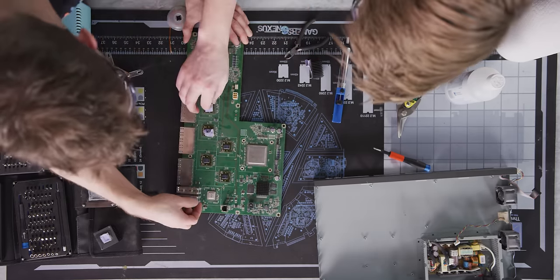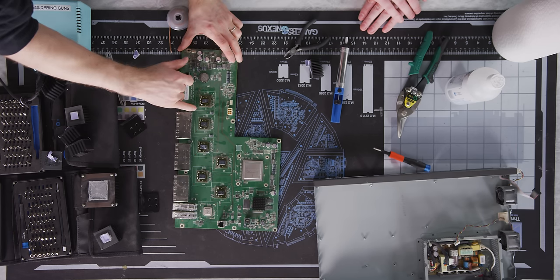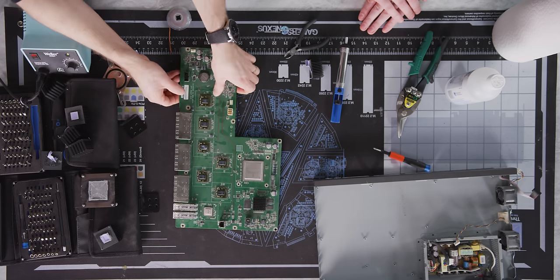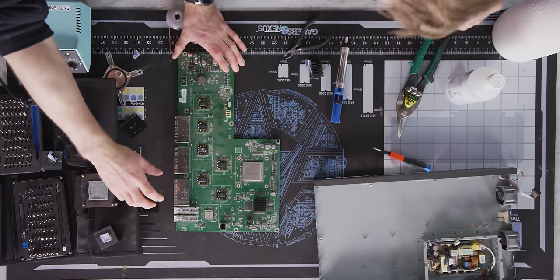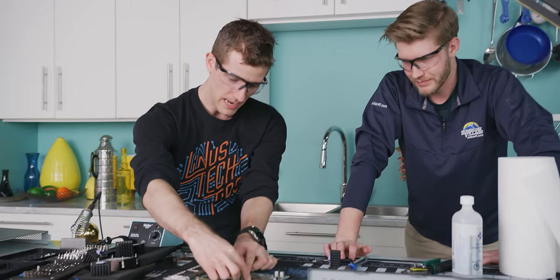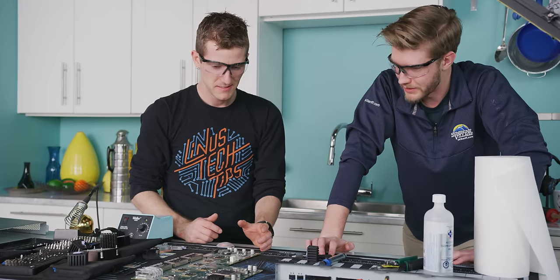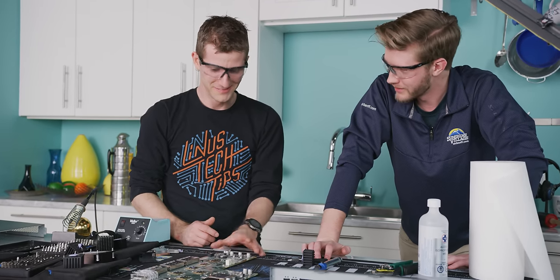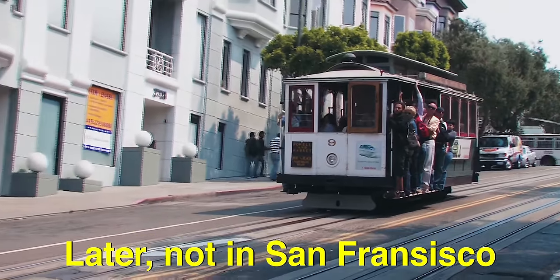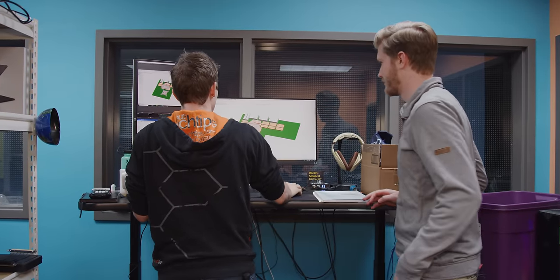So you've got a couple of challenges. These look like they're up a little high, so we might end up having to go around them. Also, not all these holes came clear, so we might have to either pop them back out or actually desolder them properly if we want mounting points for our block. Your copper slab to cover it is probably the simplest way. Here's our main CPU block — and then we do a short heat pipe here and a long heat pipe there. This is actually going to be pretty difficult.